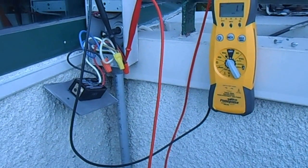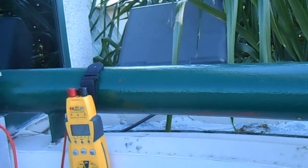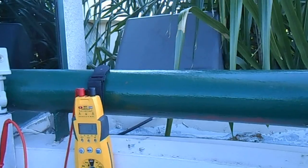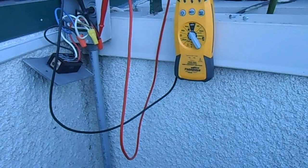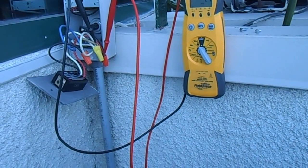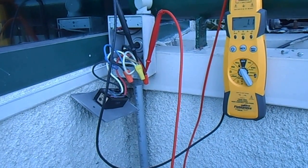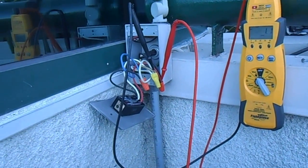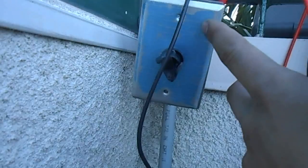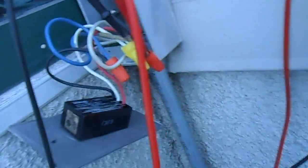We're here on the third floor balcony of the big building. We've got one of our nighttime spotlights — HID lights, one on either side of the third floor balcony. I was here late last night and noticed it wasn't on. It's kind of a pain to change a bulb, so the first thing I do is test the photoelectric eye. You have to wait five minutes; I taped it off to simulate darkness and put it on about a minute ago.